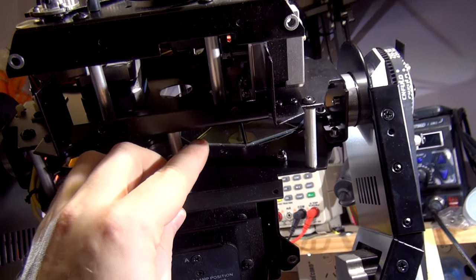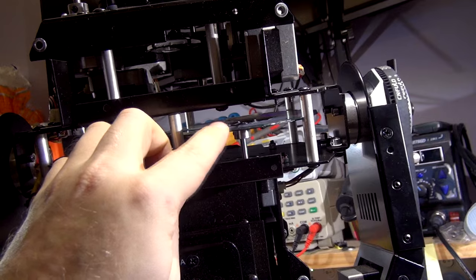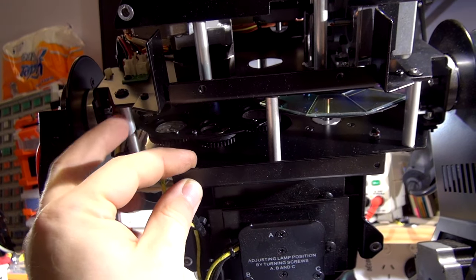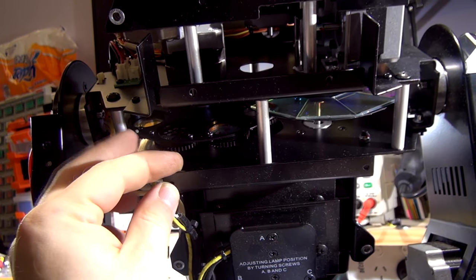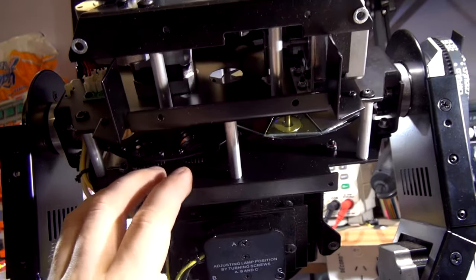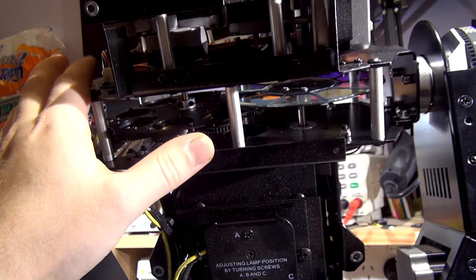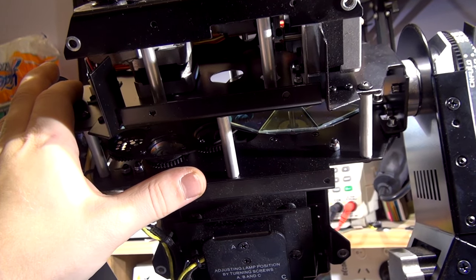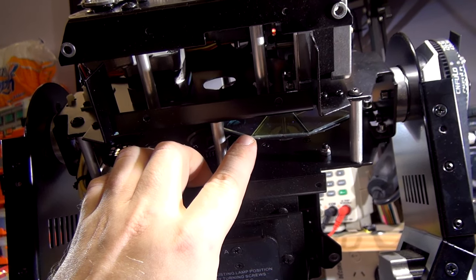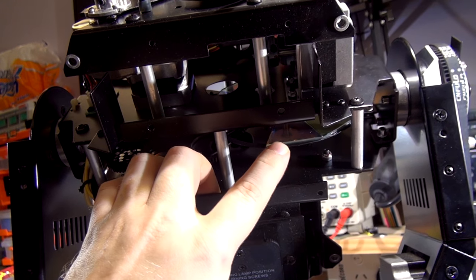The color wheel is a stalling one — there are no magnets or sensors, it just stalls against the end. We've got a gobo wheel that also stalls when it reaches the end, and it has rotating gobos. The downside to this light is the color is selectable only in discrete steps. In the other light, if you select value 10 from 0 to 30 it'll move the wheel to the middle, 20 moves a bit more, 30 moves to the next position.